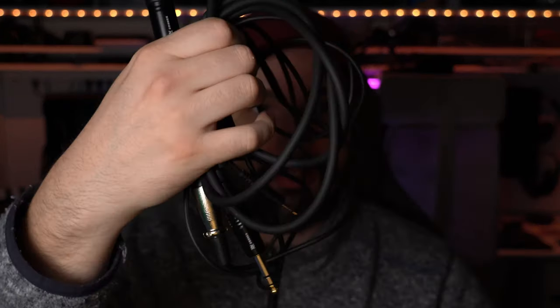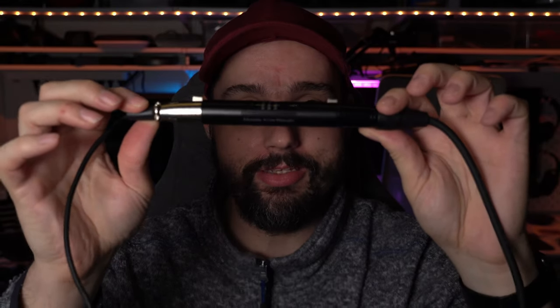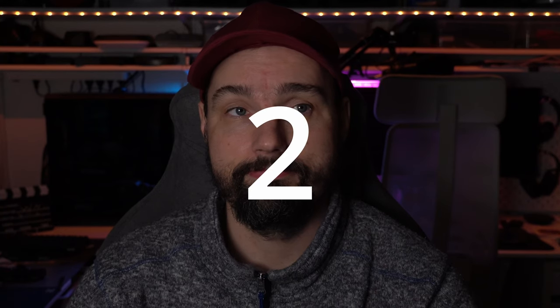So the MA-123 — let me stop the video, plug all this cable mess into my camera, play around with the levels, and get back hopefully recording straight into the camera. So I've connected the JTS to my mixer — line level sent — and I'm also recording onto my little Zoom recorder as well. Sadly I still get that humming sound. Just take a listen to the recording going straight through from my mixer — you can hear this buzzing humming sound.